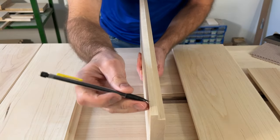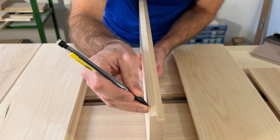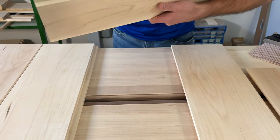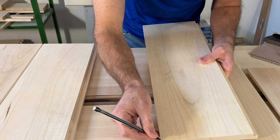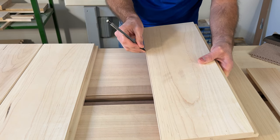Because the marking gauge lines are hard to see, I'm going to use a mechanical pencil — the leads are fairly sharp — and go down that marking gauge line using my middle finger as a bit of a fence down the side of the board. Same thing on the other edge: middle finger like a fence to guide the pencil right along that marking gauge line.